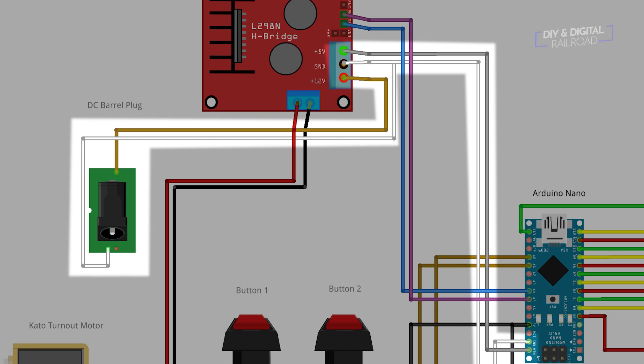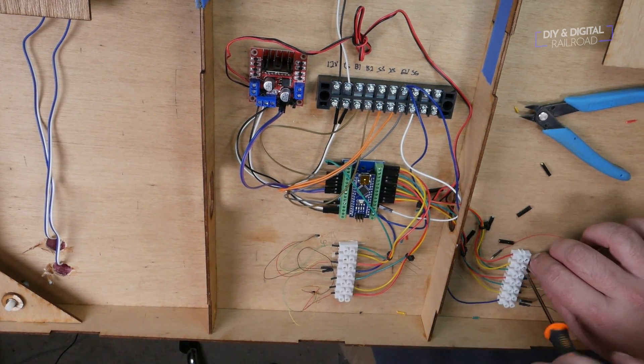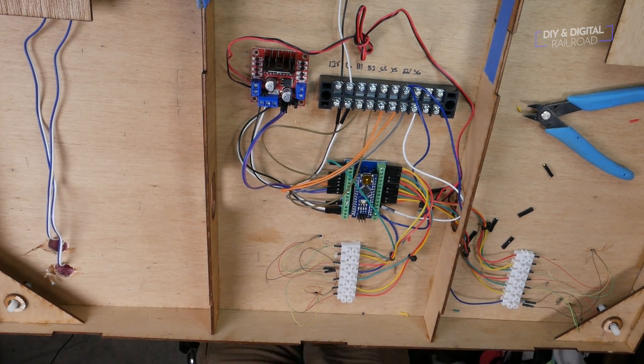We'll route five volts from the Arduino to the buttons and signals. We need to split the ground of those buttons between the analog pins and the ground connections, putting a 1K resistor in between. One weird thing: I could not connect both buttons to the exact same ground connection point. I had to connect them at two different points along the ground run — one going straight into the Arduino and one going through the motor driver path to the Arduino. Putting those 1K resistors in between caused it to not distinguish between the two buttons being pushed, so that was a quirky issue with this project.